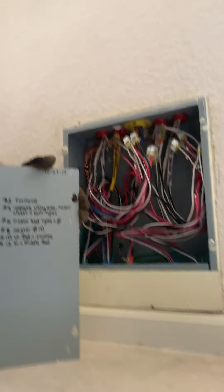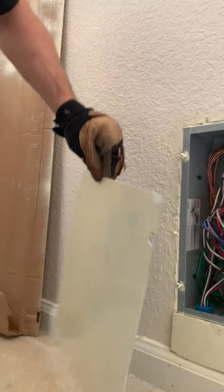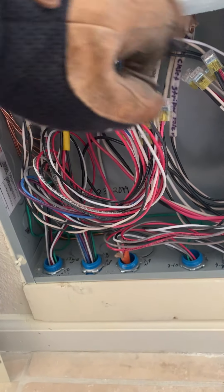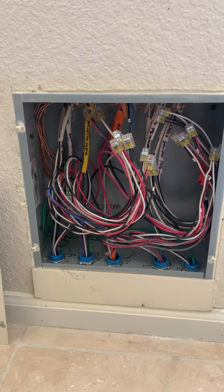On the back, I labeled my circuitry in here. Labeled the conductors coming from downstairs. Labeled my wires with sticker tape and my conduit raceway. There are only 14 circuits in there, so I don't think the inspector is going to give me a hard time about a 12 by 12 by 4 inch. That turned out really nice — that was the back feed through the panel.